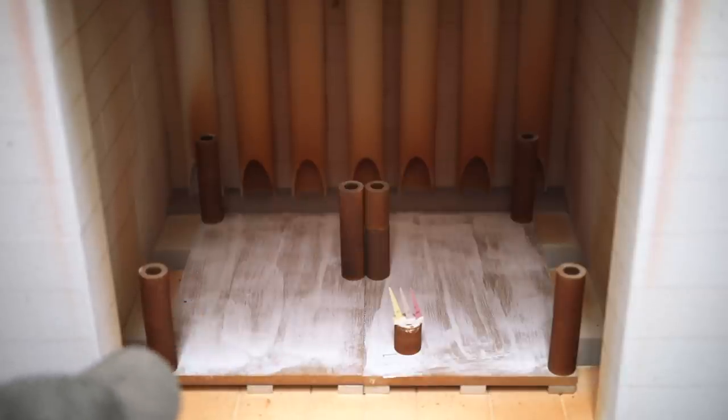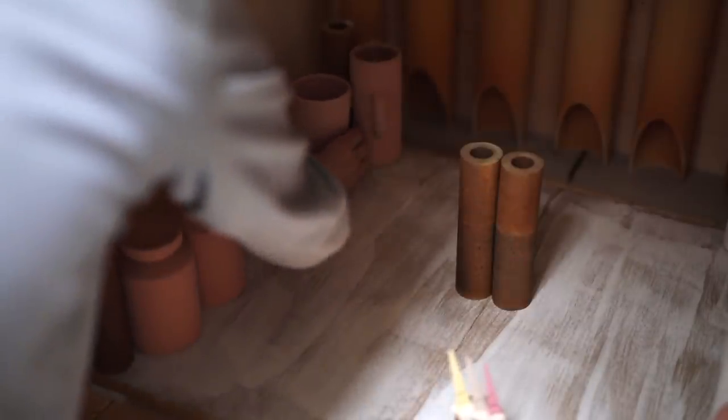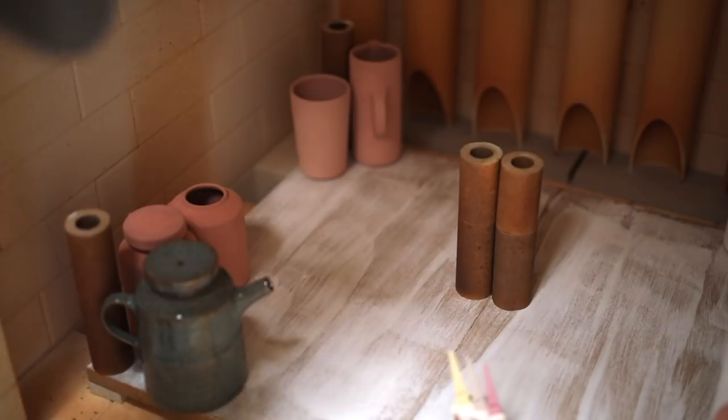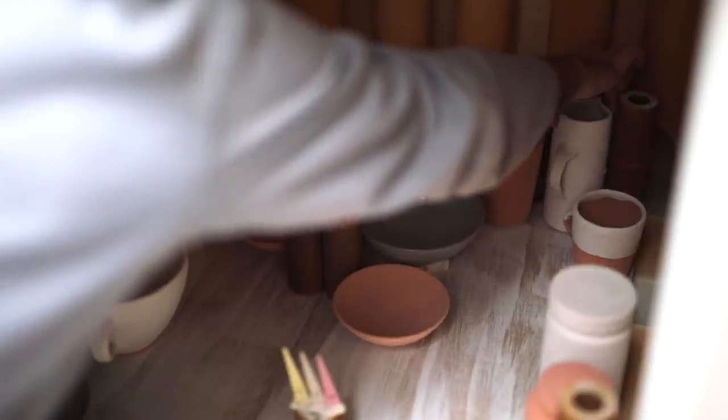The shelves above this can differ, and they can also be packed incredibly tightly and still reach the correct temperature. The only other general rule I follow when packing the kiln is that no two pots can touch one another, otherwise they'll fuse together, so I take care with every piece to leave about 2 or 3mm between them. You'll also notice that I'm placing in some pots that have already been fired — they mostly go at the front of the shelves by the cone pack. The very front of the kiln always fires a little bit cool, so I place pots there that just need another dose of heat, or perhaps they've crawled a tiny bit, so I place some extra glaze into those areas and then re-fire them to fix them. And truthfully speaking, some of these re-fired pots end up being the nicest pieces that ever emerge from this kiln.